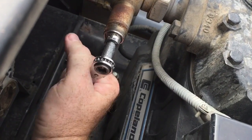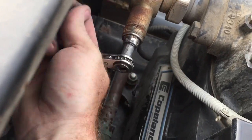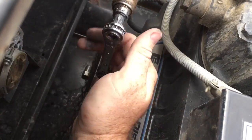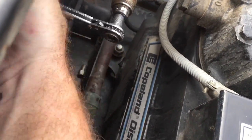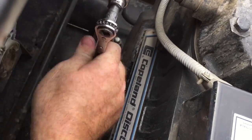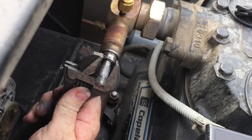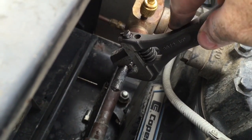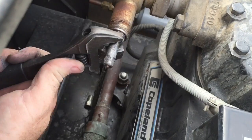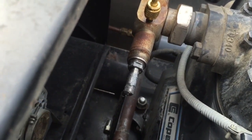I'm not going to crank it down too much just yet. I'm going to run the stem in — you want to have the power off because you're going to run it all the way in. Then I'm going to run it back out. There it is — one service valve re-packed. See you later.